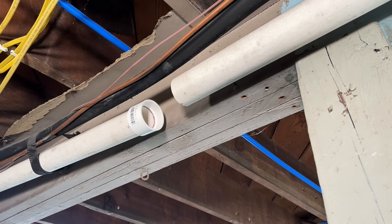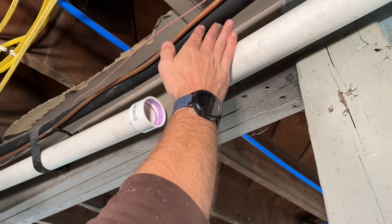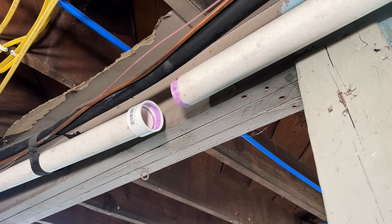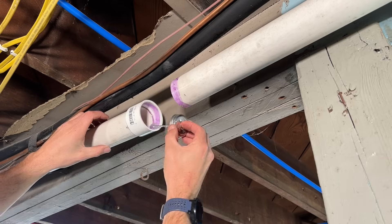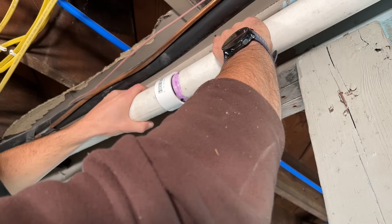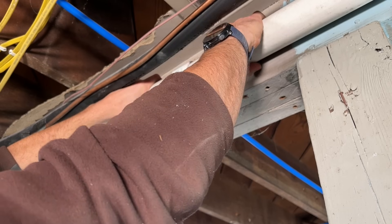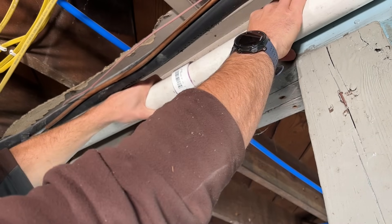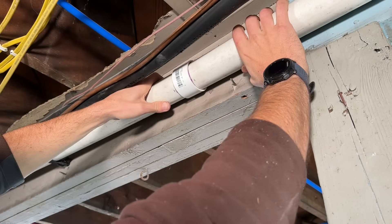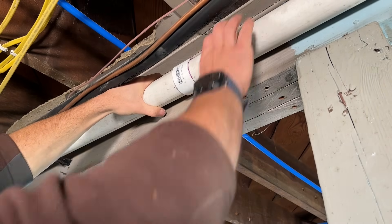Then we'll move on to our other side, doing the same steps again. Priming takes a little getting used to — usually you'll get too much primer and it will run all over the place. With the cement, you do not have much time once you put the primer and cement on; you should be doing this in a quick application of about 10 seconds. Push with a slight twist, and I would hold this for quite a while — especially in this instance — because when you let go it will actually try to pull the pipes apart. You want to make sure it's fully set up before you let go, or you might have it backing out, which could cause leaks down the road.